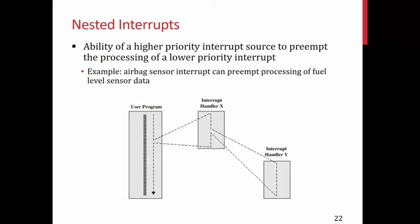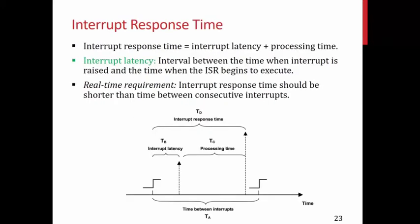When I press a button, I know that the output must react within a certain time. For example now, when I press the arrow button to change the slide, the microcontroller here most likely is not polling for the button. On this device, the microcontroller is just waiting for a button to be pressed through an interrupt. So when I press a button, it should know which button has been pressed, and it must send a signal to change the slide, or to shoot the laser. How much time am I willing to wait? That is your response time.